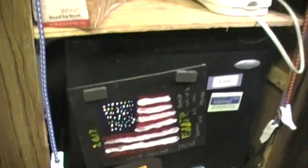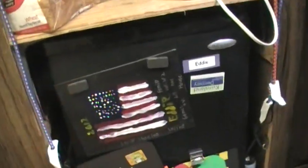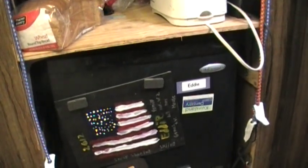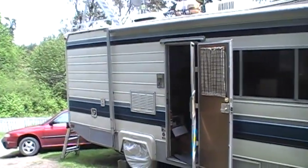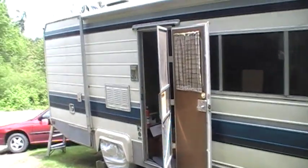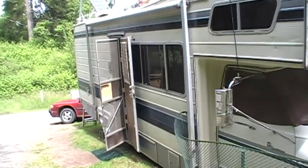The only thing I don't have set up yet — and I'm going to do it soon — is to get the refrigerator on a relay. My propane refrigerator died and this one is 110-volt only, so I need to set it up so that when I switch over to the inverter, it shuts off rather than trying to run off the inverter, because my inverter isn't good enough to handle it. Before I say goodbye, I'll get one more shot of the outside of the motorhome. Someone requested to see the exterior — they had a Dodge Pioneer in a different color scheme. This one has been repainted at some point and I definitely like the color scheme. Take care YouTube, talk to you later.